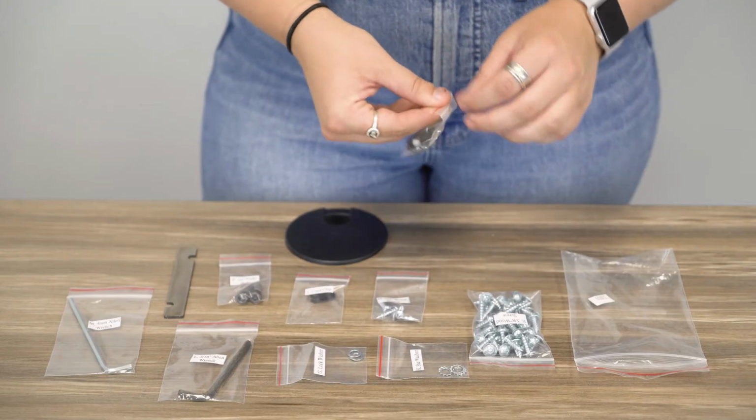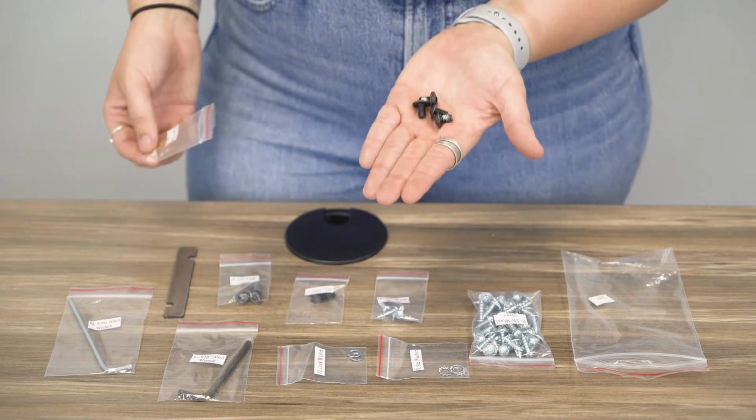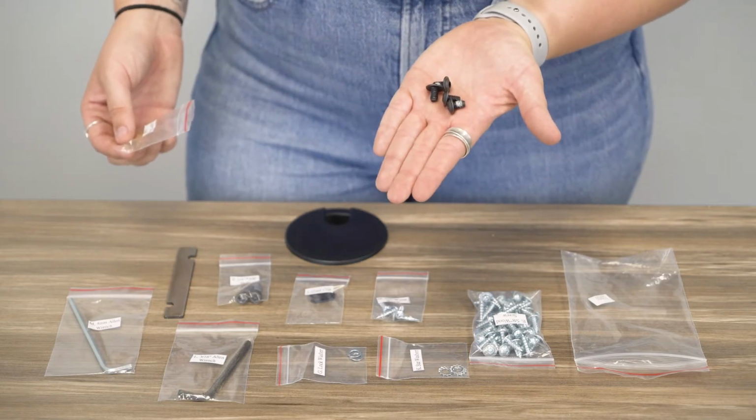This is where Threadlocker comes into play. The Threadlocker will help to fill those spaces and gaps between the fastener's threads and the material it's holding onto. Now, the bond is much more secure. Here's what you should do. Check and look through the hardware packet provided by the desk manufacturer. If you see thread locking material on the bolts, you're good to go. If not, you can easily buy some at any local hardware store for about $5 to $10.